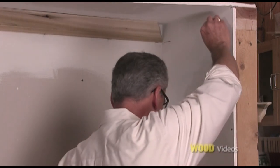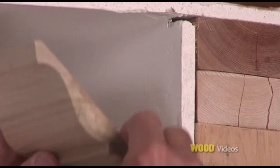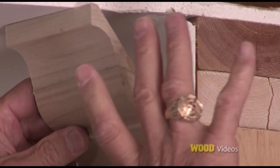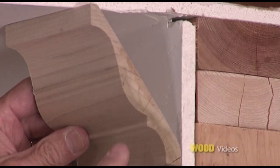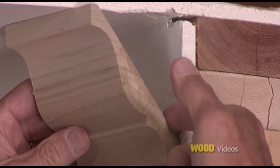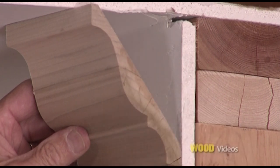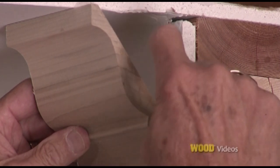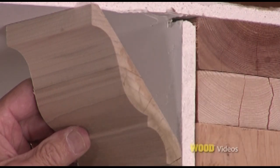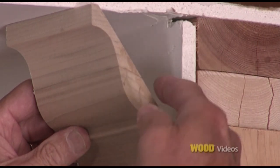The only place that you won't have that ability is when you're doing bigger trim like this. And some of these get really large. A piece of trim sitting like this, a nail through this corner, has an awful lot of area between here and the wood stud. You may not be able to find a place to get a good purchase. So you may have to look for the vertical studs in this case, or provide a batten strip, a little wood batting, all the way around the room to give you a little bit more wood surface area behind this piece of trim.